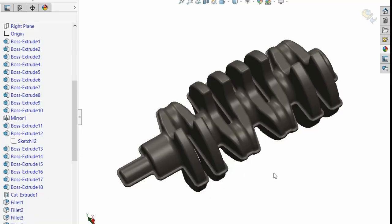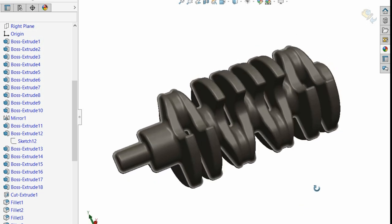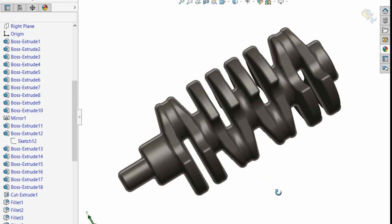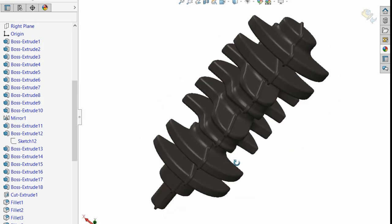So this will be done. It can be done in-house, or it can be done at one factory. So they can do the forging and then do the temperature control and the heat straightening or the warm straightening, stuff like that. You can also do heat treatments. You can go through normalizing heat cycles. There's a lot of things you can do, inspection, so on and so forth. But you can actually just ship these like this to a factory, right? A machine shop part of the factory kind of thing. So that's what we've kind of got here.